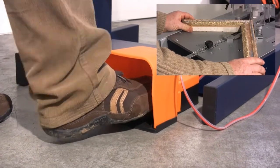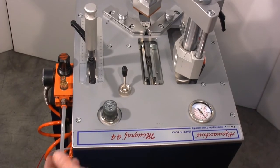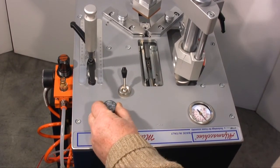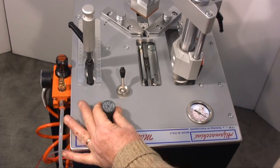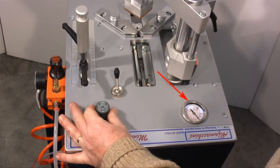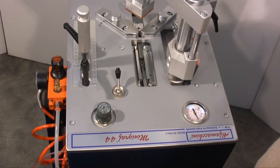The pedal makes the spring which pushes the horizontal presser work. The two tubes with two different colours which come out of the pedal have to be inserted in the two fittings of the same colour. The machine is also provided with another pressure regulator which works on the pressure entering the machine and is needed to adapt according to the hardness of the wood of the frames. To change the pressure you have to lift the knob so that it rotates clockwise or anti-clockwise. The gauge indicates the pressure. When the desired pressure is reached you block it by lowering the knob again. 2.5-4 atmospheres are sufficient for soft woods, 4-5 atmospheres for medium hard woods, and 6-8 atmospheres for hard woods. Note that the pressure of this regulator cannot be higher than the pressure entering the machine.